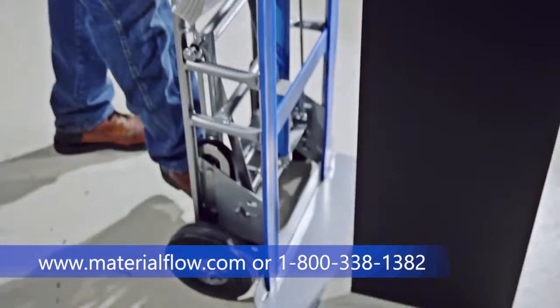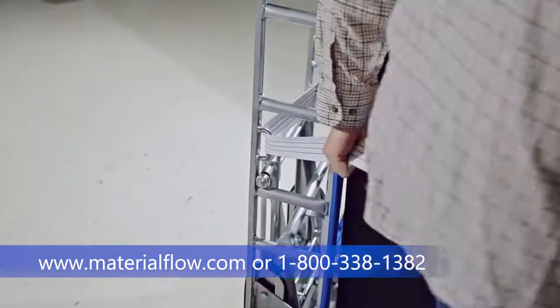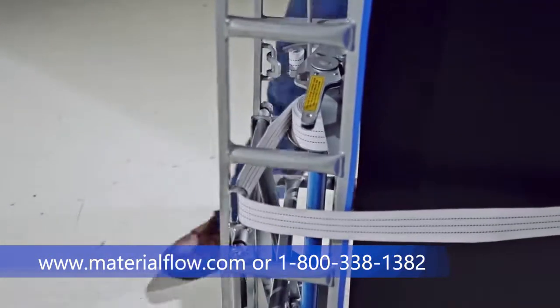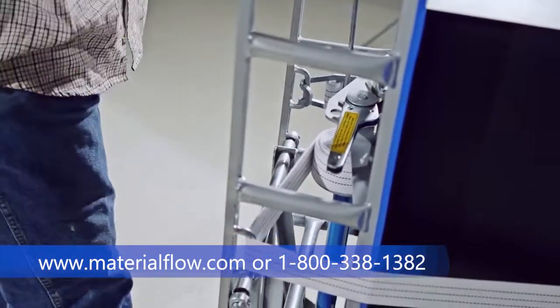Then you want to position the item you're going to lift on the hand truck like such. Grab your belt and give yourself a little slack, bring the hook around into the loop on the other side, and let the spring bring up most of your slack. Reengage the ratchet, give the crank to pull it tight, and you're ready to go.